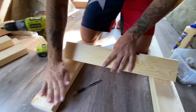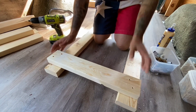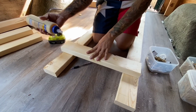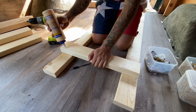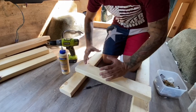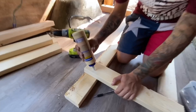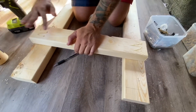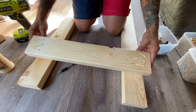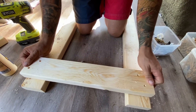Make sure you get all this sawdust off, and then you're going to line your lines up and make sure they're good. Then put your wood glue on there, but you only want it to go right here. Don't do circles, because that puts air pockets - when you stick them together it'll want to shift. If you literally just get in there and do like that, it'll be fine - zigzag, whatever. Some people smooth it out, I don't really worry about that. But this way when you smash it, the air will be pushed out. Learned that the hard way back in the day.